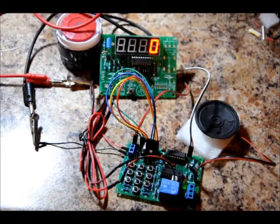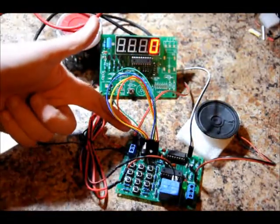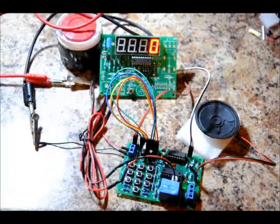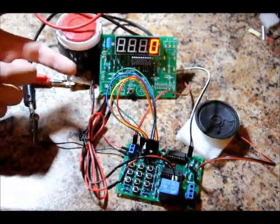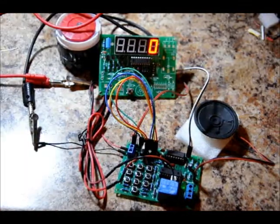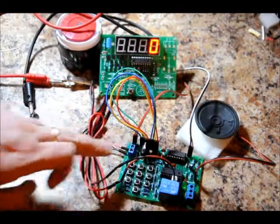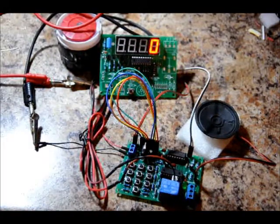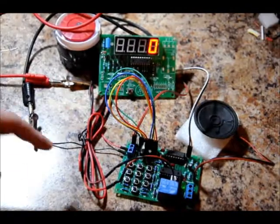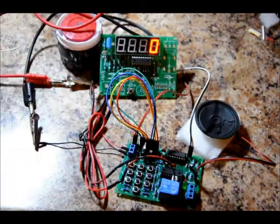Code programmed, program wire. Now, there's 10 wires here. The 2 on the left are interfaced with the countdown timer board, which we'll get to in a second, and then there's 4 wires on the left, 4 wires on the right. The right 4 wires are common pins, and each of those is connected to the 4 wires on the left labeled W1 to W4. Wire 1 is basically the default. If I press S1 right now, it will default to wire 1 being your deactivation wire.